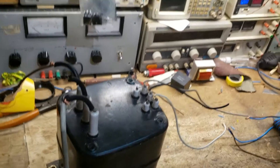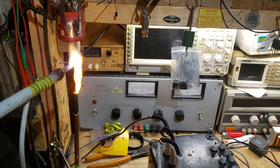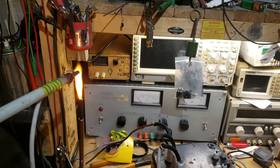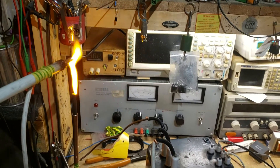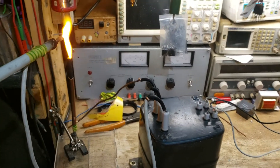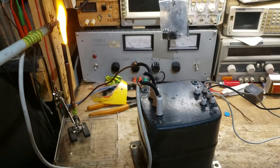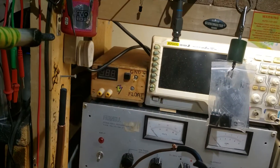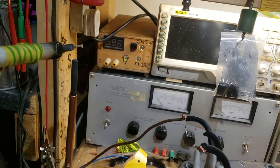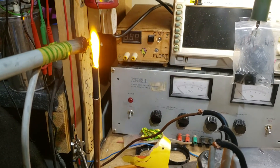Right guys, we'll just start pulling arcs off this and we'll see how the ZVS stands up. I built this ZVS some time ago but it's a nice, well put-together unit. I'd also like to measure the input voltage to the ZVS and see what we're running at. At the minute we're not actually putting out that much voltage but there's a lot of current there - it's not even jumping that far so it's capable of a lot more. Saying that though, 10 kV is only a centimetre.